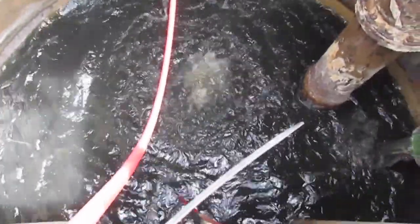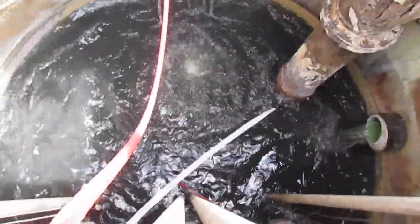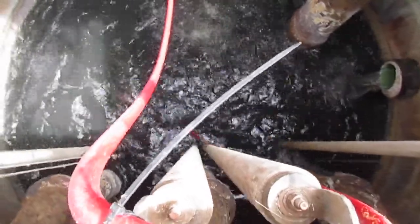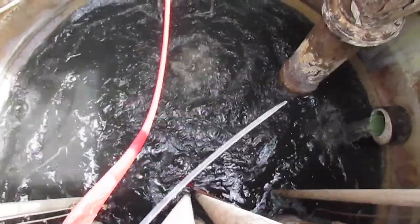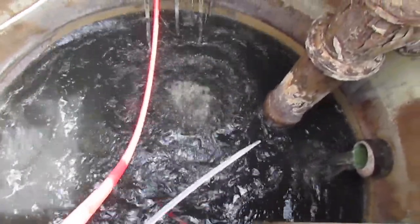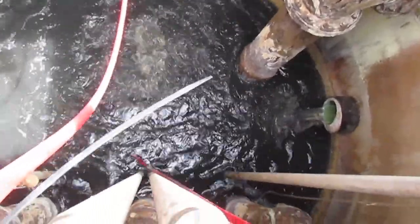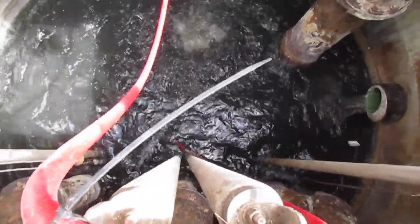Within several weeks, no matter how much grease was in the wet well at the time of wizard installation, the lift station will have a clear water appearance and there will be no odor coming from the well. As long as the Wet Well Wizard system is allowed to operate, the water will always look clear and without odor. Floatable, undissolvable trash will be floating at the top, free and clear of grease or scum, and can be retrieved simply with a screen scoop.